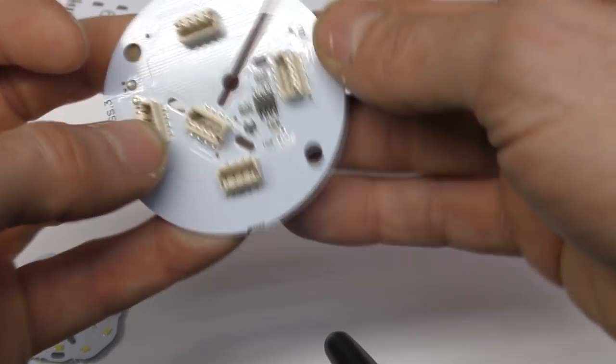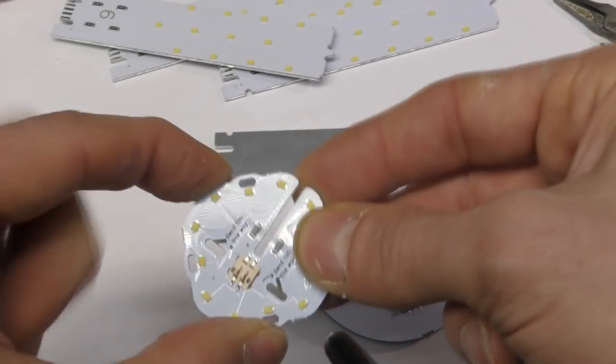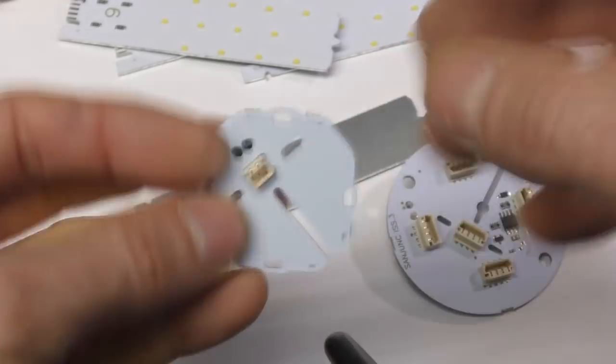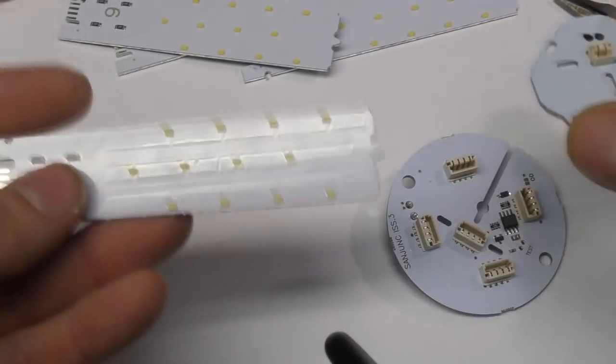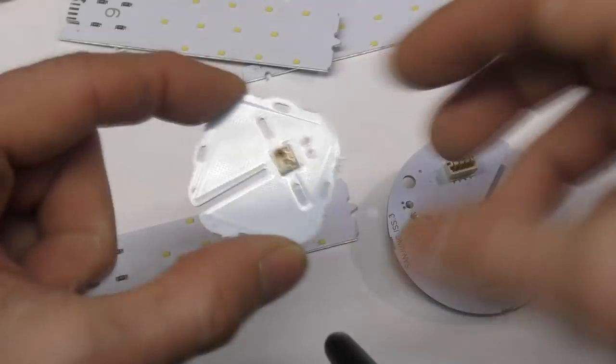We had to have it connectable from the top, so there was really no choice about doing that, I suppose. It might have been possible to use the through-board versions of these connectors, but it didn't seem to make a lot of sense to do that. And this one basically got put on the same panel primarily for panelization reasons. It would have been quite difficult to panelize this on the same board as these, purely for efficiency reasons, but also because of the whole business about getting the right number of these strips on a panel. If we'd also had to get the corresponding number of these, it would have been even more difficult.